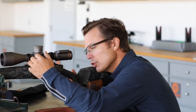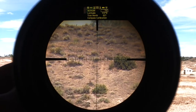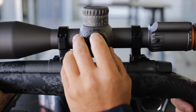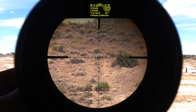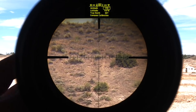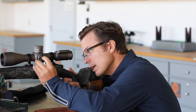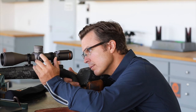On the azimuth, we're going to do it just like we do the temperature override. I hit enter once, so now the highlight is around the auto portion that I want to adjust. Then I'm going to go up and down — this is in degrees, so you'll have to enter your directions by degrees. I'm going to go 180 degrees, which would indicate south. Then hit enter to save it and press and hold enter to return to the main menu.